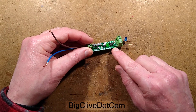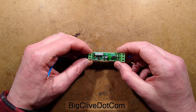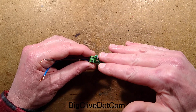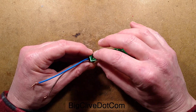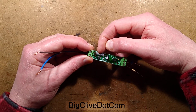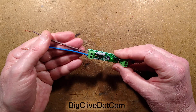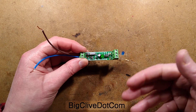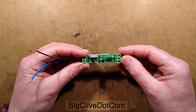If you ever get involved in designing something like that, grossly overrate this resistor. A one watt resistor - I'd never use it at one watt, I'd use it at most half its rating. So many faults come from one, two, three watt resistors being used right at their limit. They get so hot and stay so hot that they don't just carbonise the circuit board - the whole circuit board goes black in the vicinity. Carbon film resistors in particular can darken, carbonise, and actually change their resistance characteristics - going down in resistance. There was a case of fan run-on timers in toilets where a resistive drop to power triacs caused so much dissipation that when they failed they were smoky and flamey.